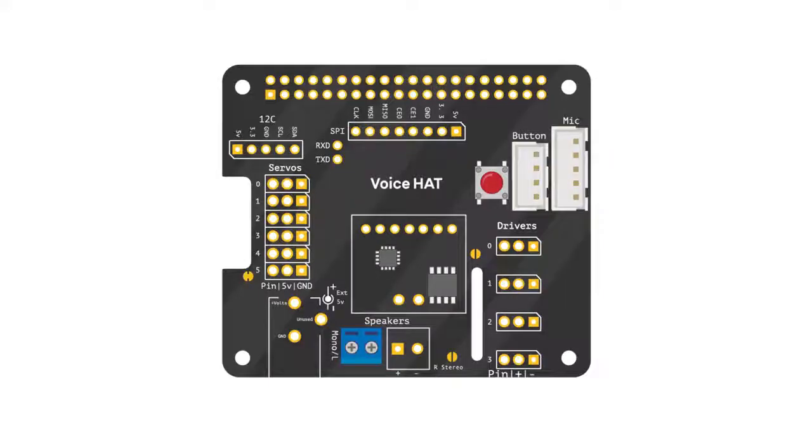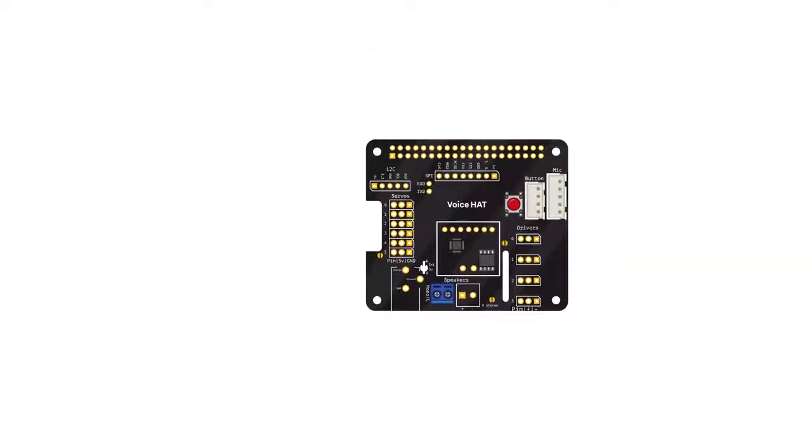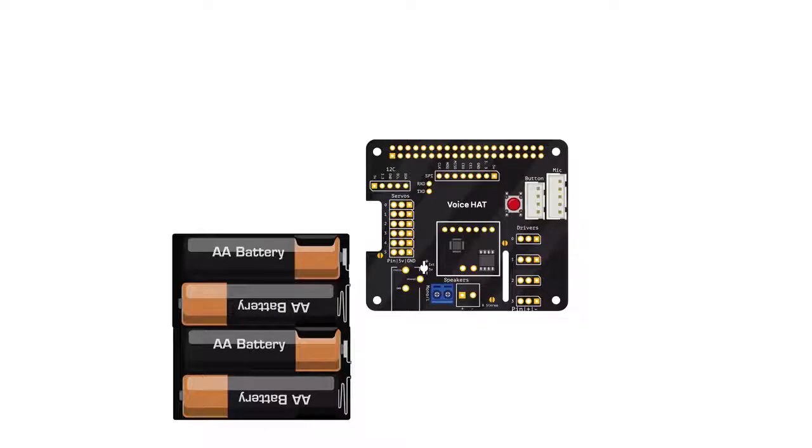There are two sides to this. The first is setting up the hardware. You should take your Voice HAT back out of the cardboard box and solder the pins to the board. If you plan on running DC motors, you should also cut this jumper marked JP1. This separates the power of the Raspberry Pi and the driver pins over to the right. You'll need to attach a separate power source, and we're recommending that you use a AA battery pack. The two wires of the AA battery pack are connected to the positive and negative pins on the bottom left of the board. Make sure you take a look at the AIY Voice HAT pin guide in issue 58 of the MagPi.